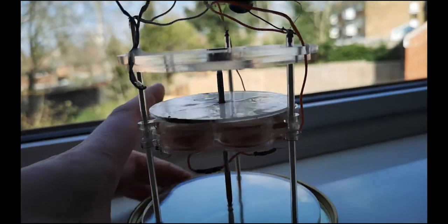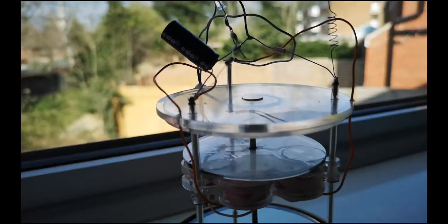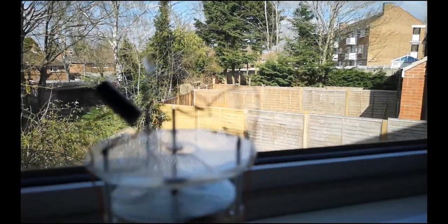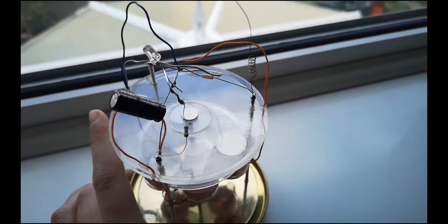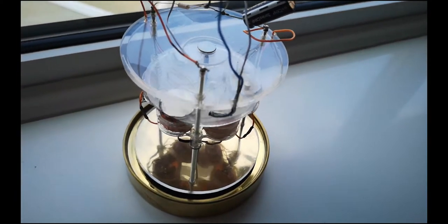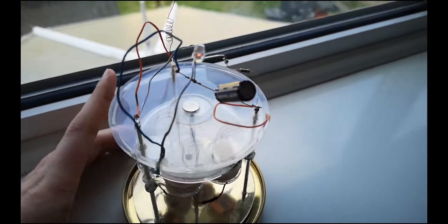And then you can see there's one of the wires from a coil that goes up to one of the legs of the capacitor there, and then the other one here goes from there, if it would focus, yeah, from there all the way up over to this side, which then goes to the reed switch here, then goes up to the capacitor, ready to get powered. That's it.